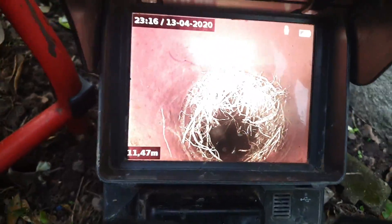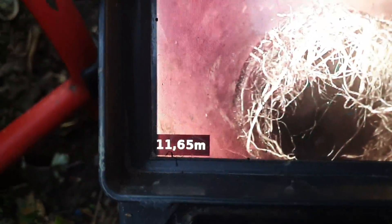You'll see when I go through, it goes through like that and back out. So it looks like there's a bit of dislodgement in the join there. So I'd recommend digging this up, taking this out and putting an inspection point down the bottom of the boundary.